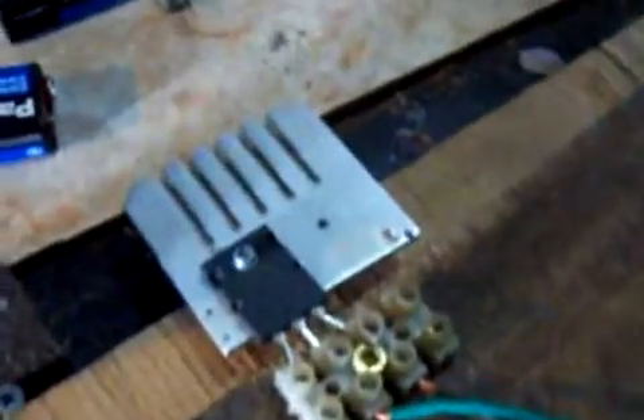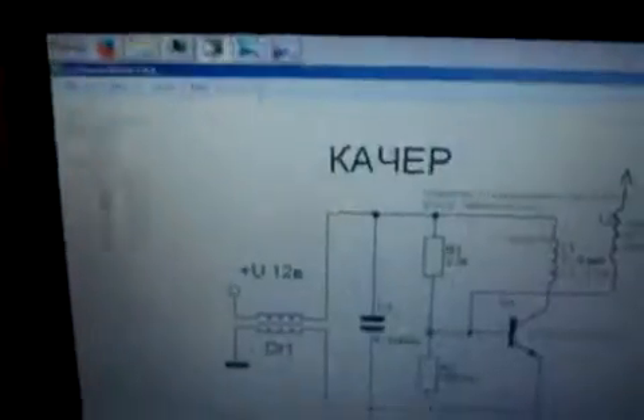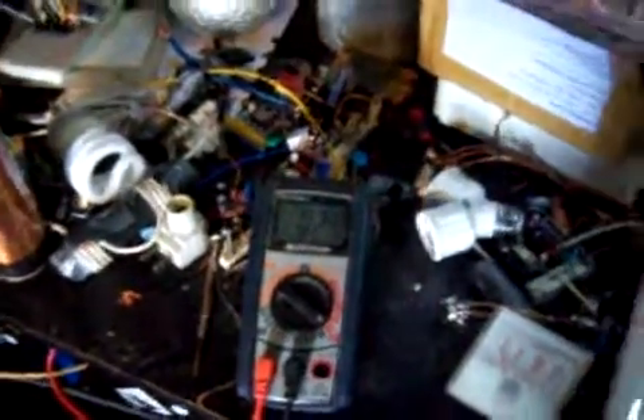It's being powered from 12 volts going to an inverter with 110 coming out, going through a step-down transformer tapped so it's at 40 volts, being rectified, and then these caps are getting charged and then it's coming up to the circuit. This is an SC5200 transistor, very good for these types of things. It's about 5 amps on 12 volts, so 60 watts. Let's check this out.